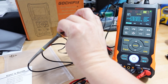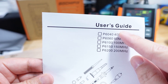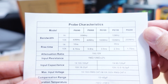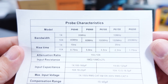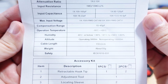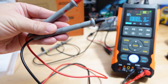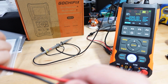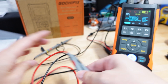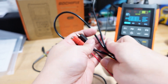The probe accessories include a small screw for adjusting probe calibration. It's a 1x/10x oscilloscope probe, model P6000 series. The multimeter accessory kit includes positive and negative test probes — the cables are a little stiff but not the worst at this price point. There's also a pair of alligator clips for positive and negative that connect into one of the BNC connectors on top for the signal generator.